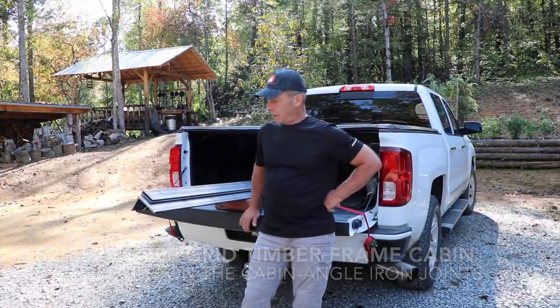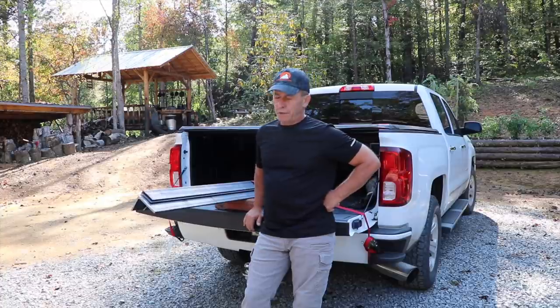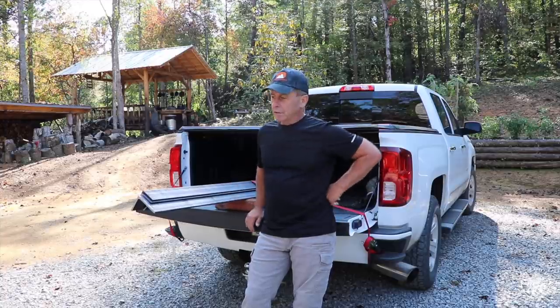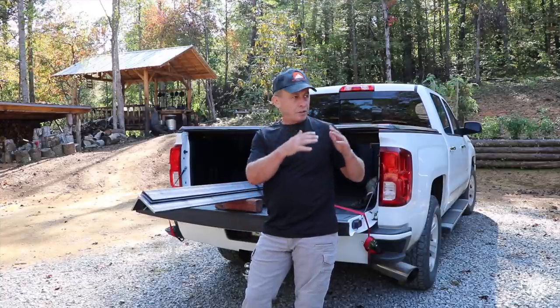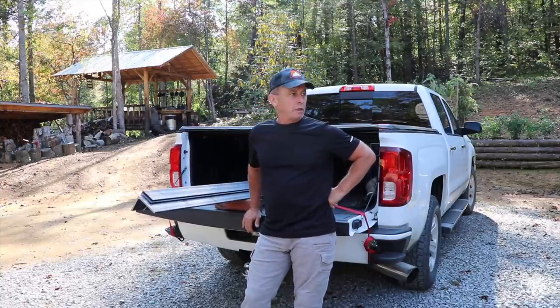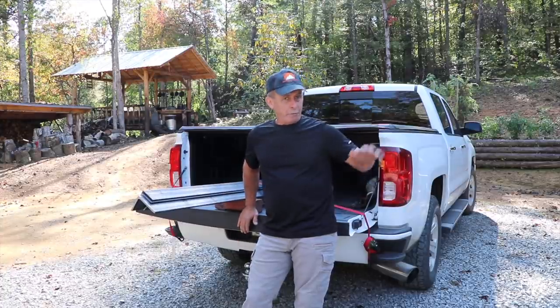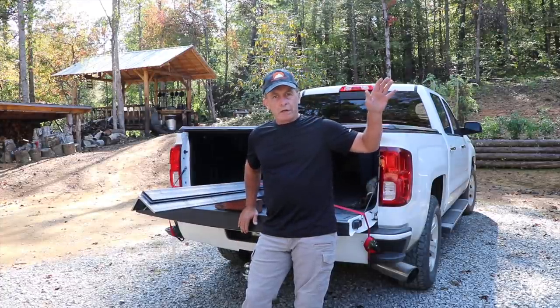As you can see right here, I've got some steel that I stopped by and picked up. I've got three pieces, 10 foot long, of 3-inch by 3-inch by 1/4-inch thick steel. And then I've got a 3x5 10 foot length of steel, because I do have to offset some of those for the cabin. What I've decided to do to make it more structurally sound, I'm going to add these at every joint on the beams on the bottom and the top of the cabin.